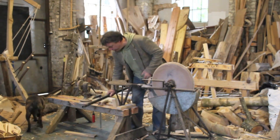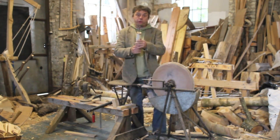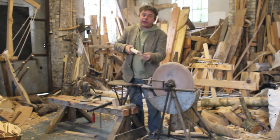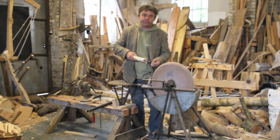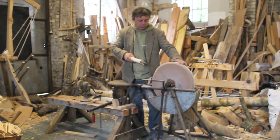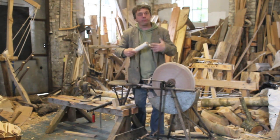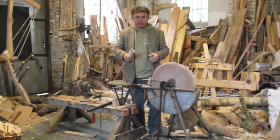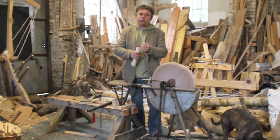There's something else I've been experimenting with, and that's a drill bit — an old drill bit just in a block of wood. Because the drill bits are fluted, if you move it around every now and again it tends to cut quite a deep groove into the sandstone wheel. Not perfect for finishing off, but to start taking the bumps off it's absolutely ideal.